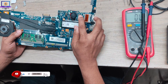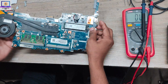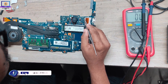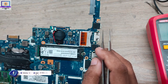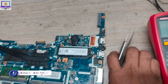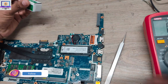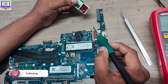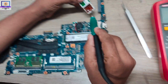I can see here three capacitors on this side. This one capacitor looks like it's faulty. I don't know which one is actually bad, so I will put some smoke here. Then I will inject voltage from my power supply into this 5-volt power rail, and then I can actually find out which one is bad.